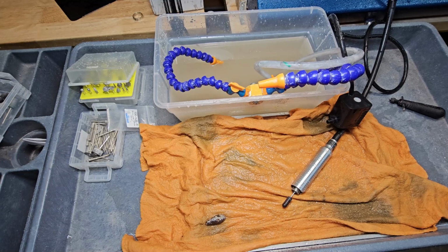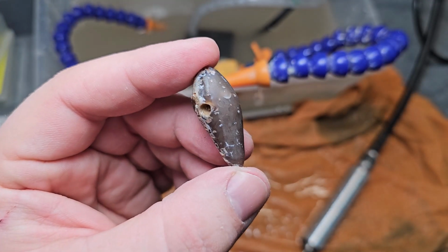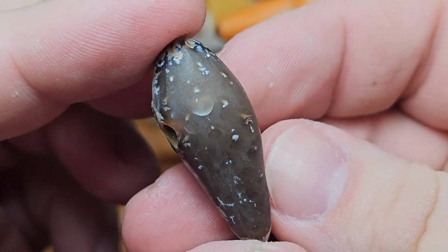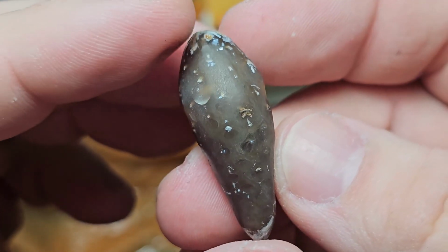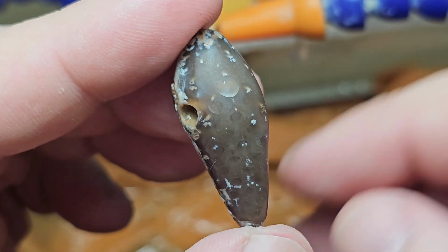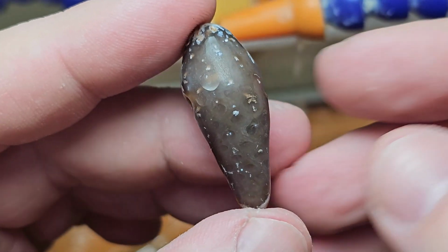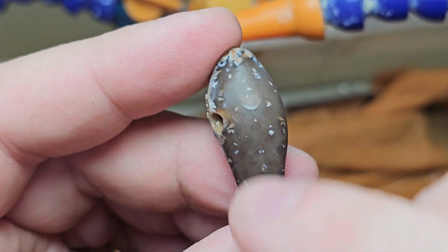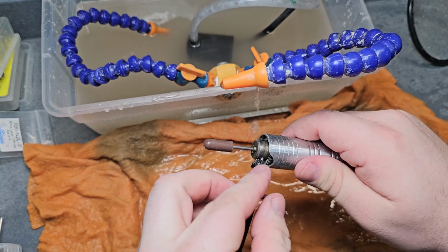Hopefully my laptop's not messed up. Oh no. Alrighty then. So this is after the 280 grit Nova point. We are ready to go on to the 600 grit. And the 600 grit will just further smooth out the surface, get rid of any scratches from the 280 grit, and then from there go to 1200. So same process as before. Use plenty of water, keep a fluid motion, and keep working in the same up-down direction that we have been. 600 grit is the brown point.